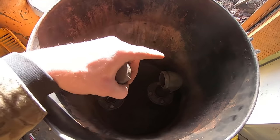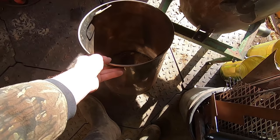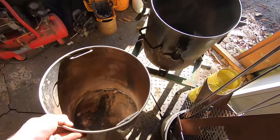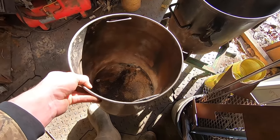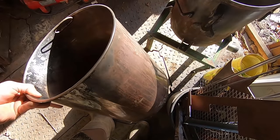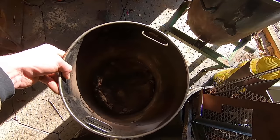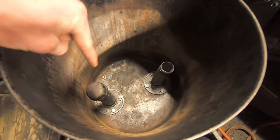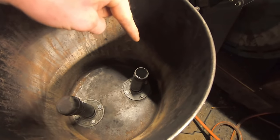And for that, now every pressure pot should have one of these. It's just a can basically that sits inside of your pressure pot, and this is what you actually put the paint in, so you can remove it and clean it a lot easier. But it's stainless steel, which means it's perfect for resisting the temperatures and the corrosiveness of the gas that we'll be putting it through. All right, so we have our gas suction tube, and then we have our air inlet tube.